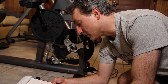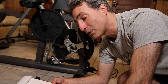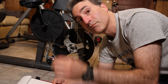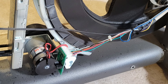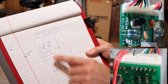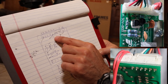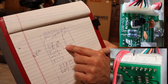That means the power to drive the motor is insufficient, so voltage is getting lost somewhere. There's probably some sort of resistance — maybe a driver that drives the motor, or maybe a wire, a bad crimp, broken wire, or broken crimp terminal in the connector. I looked at this cable, the motor, and the board, and sketched out the signal paths. What I found is that the green and white wires connect directly to the motor. White connects directly to the red, and the green goes through what appears to be an inductor and then to the other side of the motor — probably for noise suppression — and there's a capacitor that goes to the chassis.